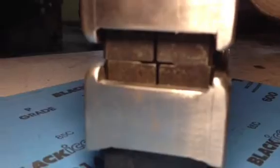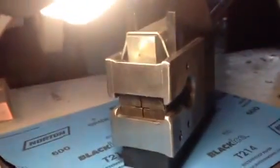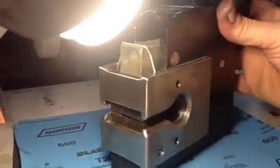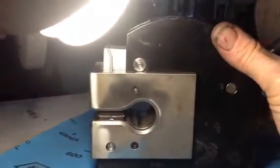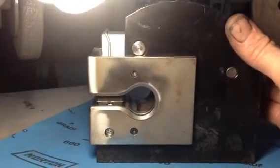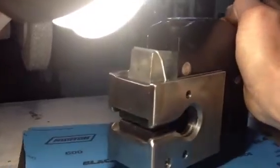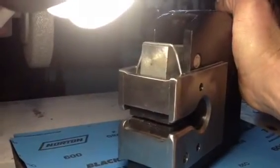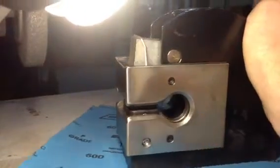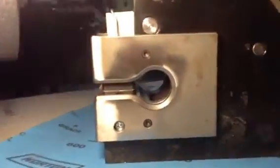The amount of shrink and the consistency, and the reduction in marring having the plates on there really make a big difference. I've used the original spring clips to hold the die sets in and used the factory mounting holes — a simple plate to go around utilizing their original screws, and a simple weld on the front pieces that I machined down to my gap. This really made the machine a lot more useful, able to pull a lot deeper shrink and stretch as well.